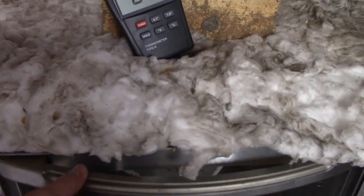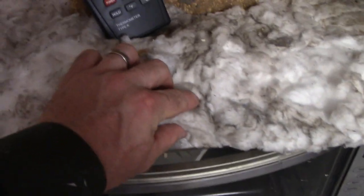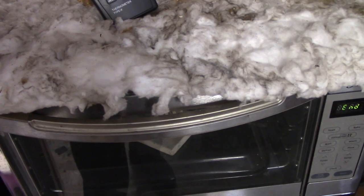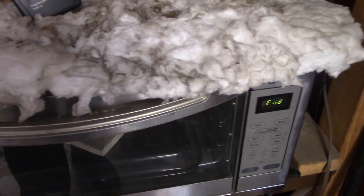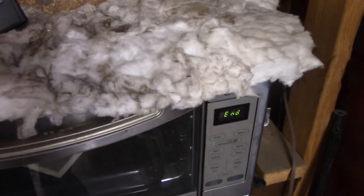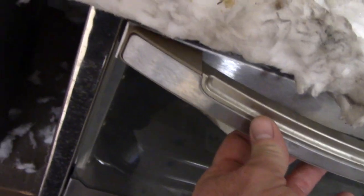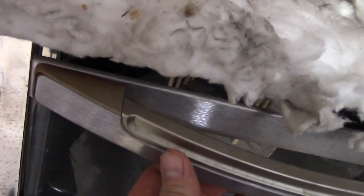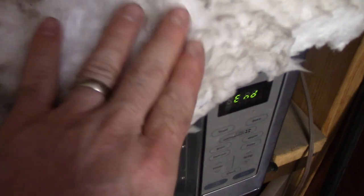But with this setup here, here's what I use. I'll set this about 20 or 30 degrees above where I need it. So if I'm tempering at about 400, I'll actually set this at about 425. It maxes out at 450 anyway. But what I do is, if you notice this little glass door, I open it almost an inch, and then I pull this insulwool down here to block that off, to seal that opening.